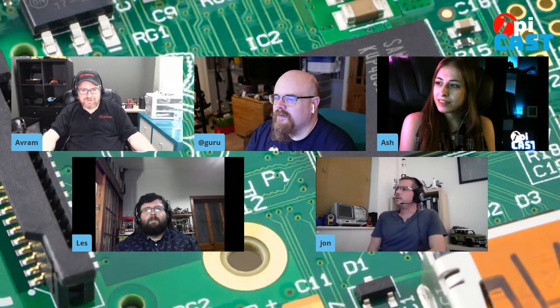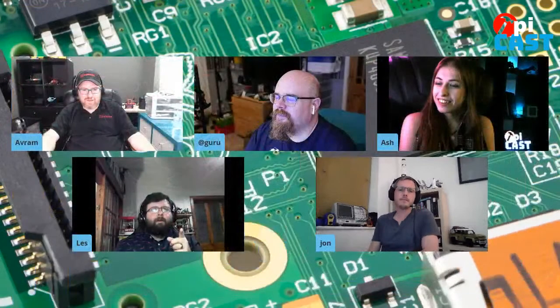What are some of the projects you've seen people do? Not much yet since it's just come out. We've had some insight under NDA with Raspberry Pi to the SDK development and have been working alongside it for the last couple of months. Some of the demos their engineers are doing are incredible — things like HDMI output, DVI output, just crazy tricks, mostly leveraging the functionality of the PIOs.